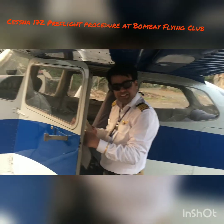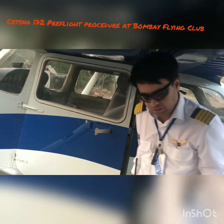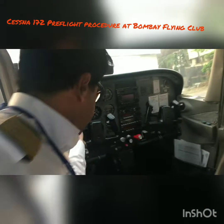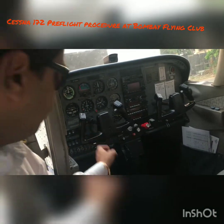Make sure the flight's weight and balance documents are in there and the papers are in place. Before that, make sure the parking brake of the airplane is set — set it by pulling it. The control wheel lock is removed; make sure the controls are free and correct and the control wheel lock is removed. Make sure the ignition switch is off — you don't want the prop to be live or anyone to play with that.